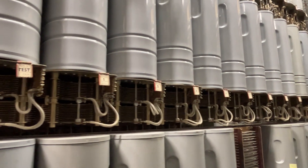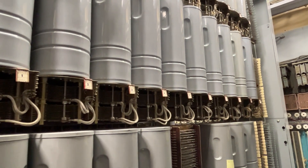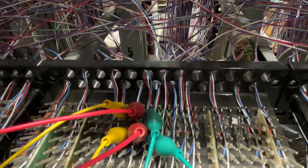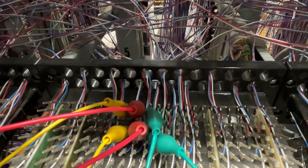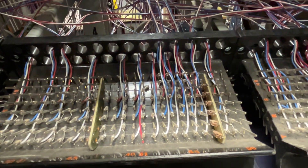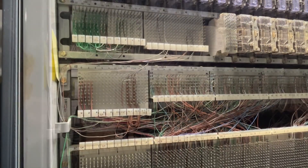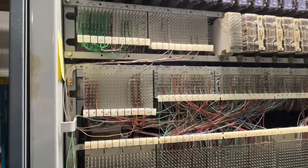Now, I have a shelf of these trunk hunting connectors — I actually have two shelves. This particular shelf in the CNET world is 37756XX. For this presentation, I just used my Radio Shack alligator clips to represent the hunting straps. This is the cross-connect side of a frame block. My number three crossbar also does hunting; I do not have any lines set up yet. I might build a hunt group in this machine in the future, but it's done at the line number translator.